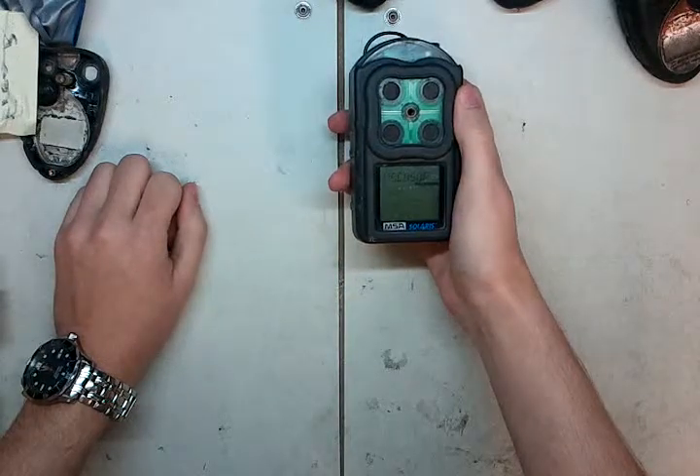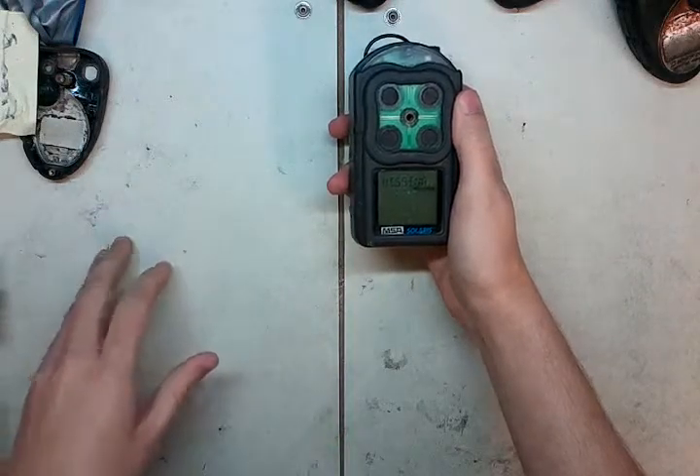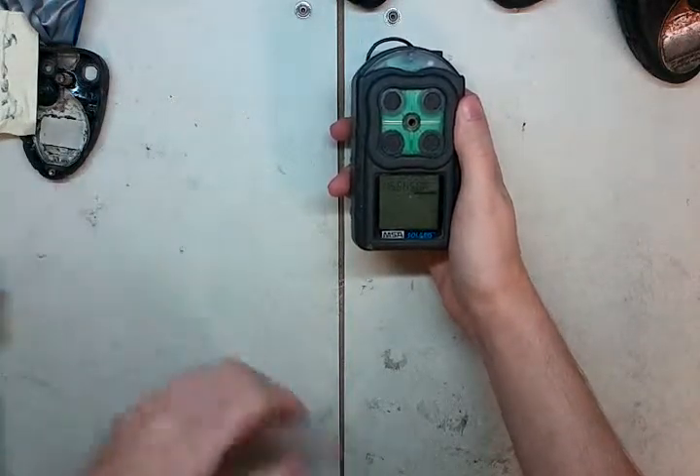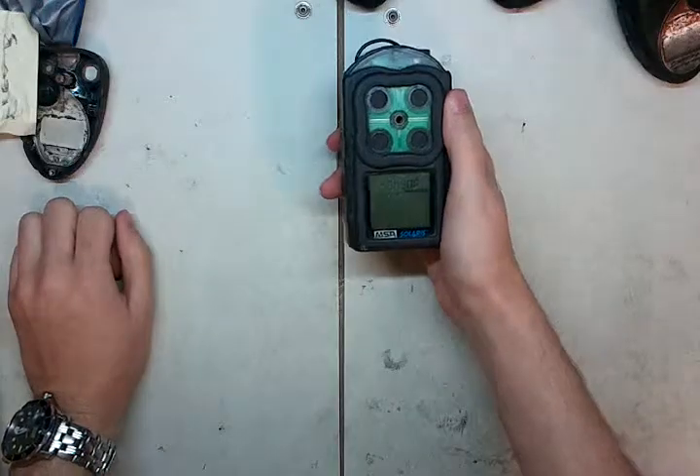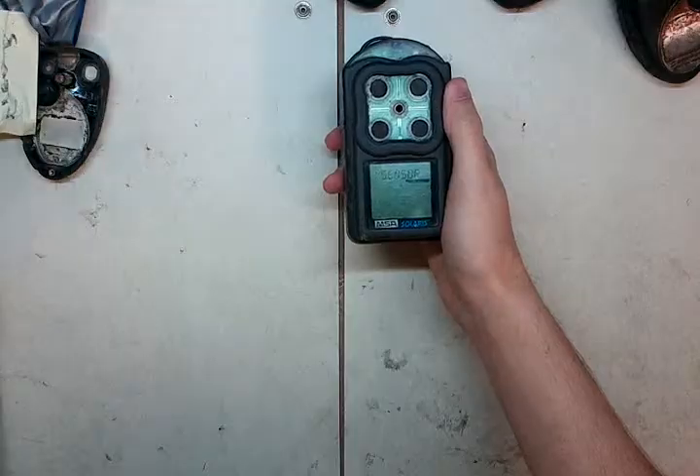The other thing it will do is, it won't go up past 20.9, sometimes it won't even get up past 18 — it won't get up to, say, 15, 12, 10. It'll give you a real low reading. What that usually means is that the sensor's just kind of degraded over time, and it's gotten old, and it died.